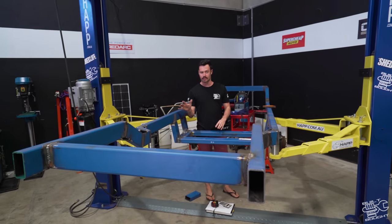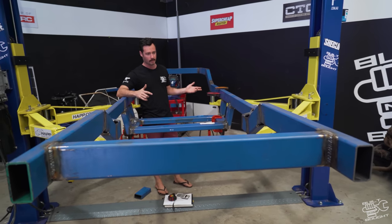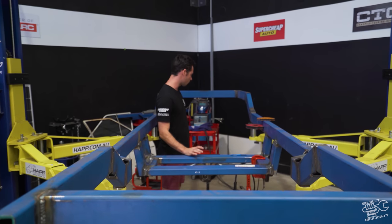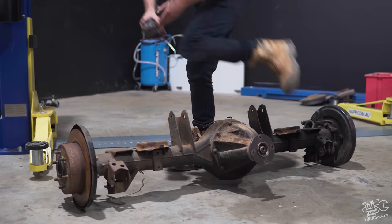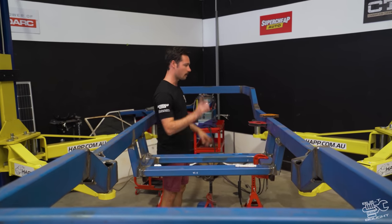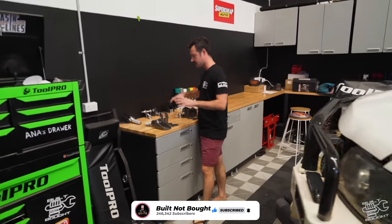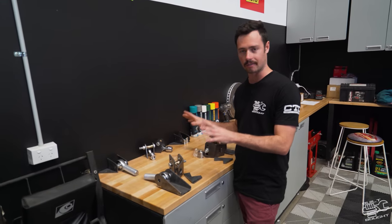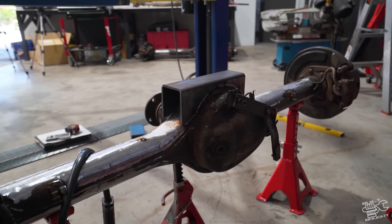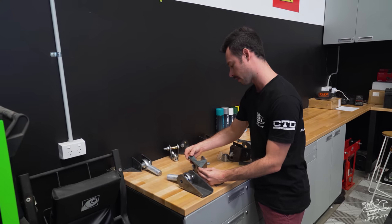It's a few weeks later. I've welded up all the chassis, started doing some gusseting, and I've got fish plates being laser cut to go on the sides. Now I'm planning out where everything will sit — this is roughly where the ride height of the chassis will be. I'm starting to look at doing a four-link for the diff. The rear diff is all stripped, front diff is stripped as well. I've gone to Dave from DesignFab — he makes all these gussets, links, joins, heims, and all the bits and pieces for a four-link. He's welded a section over the pumpkin, with tabs and heims for the top arms going to chassis mounts with braces.